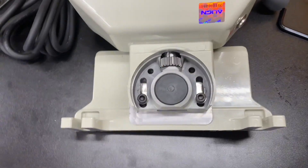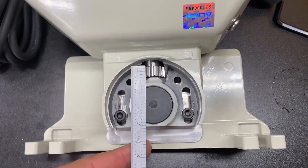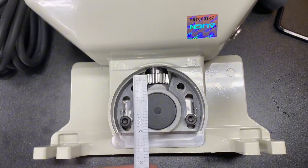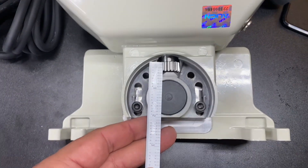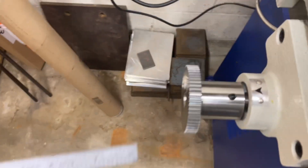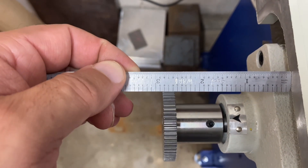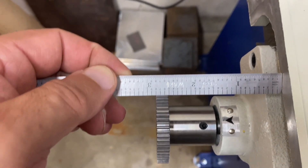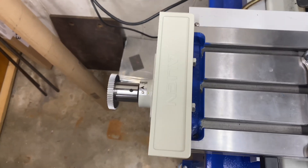Off camera I did a bunch of measuring and determined that 2.7 wasn't going to work quite as well as 2.8. So measuring with a straight edge from this edge to the back side of the gear gives me 2.8 — I adjusted it out just a little bit. Everything is tightened down except for these two screws, which may need side-to-side adjustment for gear meshing.